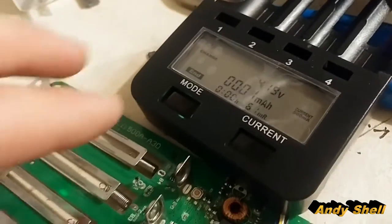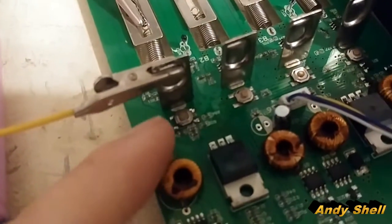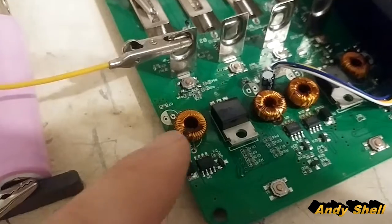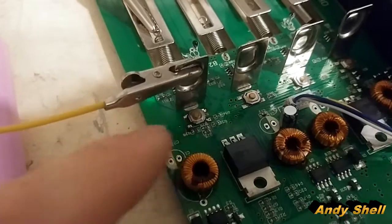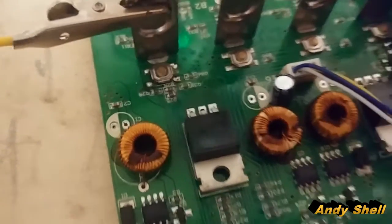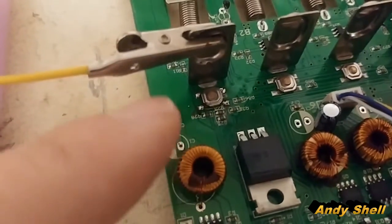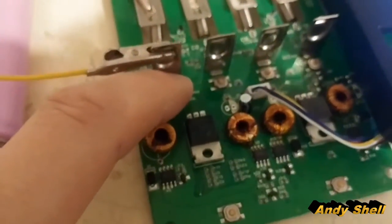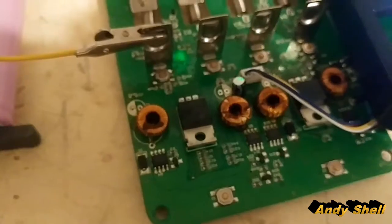The unit would start up just fine, but none of the buttons would respond. So I took it apart, heavily examined it, and then took a big risk — just assuming on gravity that the liquid would flow this way. I couldn't see any of that liquid around this section, but I could see a lot of it around that button, along with a bunch of resistors. I assumed that liquid got inside the button and shorted it permanently, so it thinks the button is always pressed and won't allow any other buttons to respond.